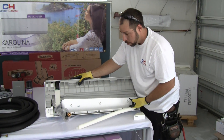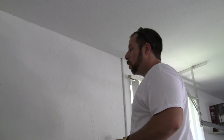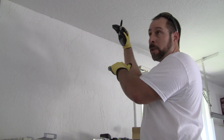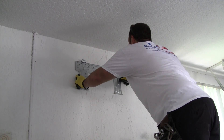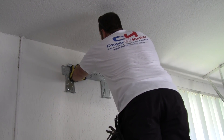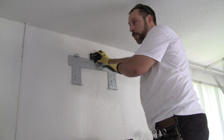When relocating the drain line, make sure to take the rubber plug out of the new side and plug the old side, so that all your drain, copper, and electrical come out the same hole. Once you've decided where to mount your air handler, get the center measurement on your bracket and mark it. Keep the unit about six to eight inches below the ceiling for good airflow, and make sure it is completely level — the system has a pitch in the existing pan, so no need to tilt it toward the drain line.